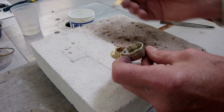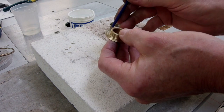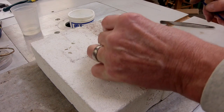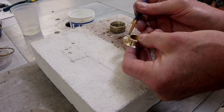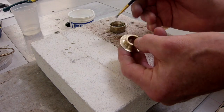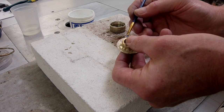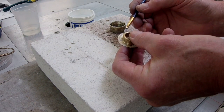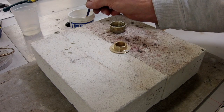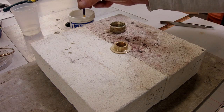One thing I forgot to mention: the inner cap came to me just flat and I machined a small indent around right where the outer cap needs to go so it'll lock in place. And I'm going to put some flux on the inner cap assembly on the base plate here. I took 400 — or maybe 600, I don't actually remember — grit sandpaper on the cap so that all the joining surfaces would be nice and shiny and clean. Clean metal is the key to brazing.